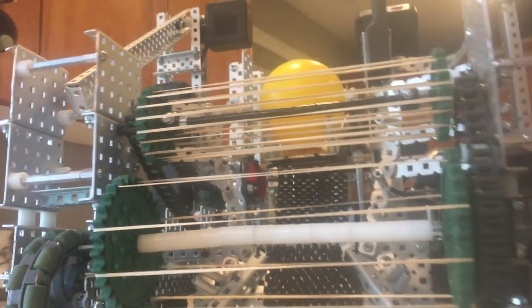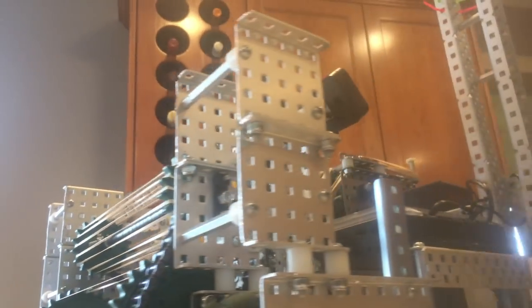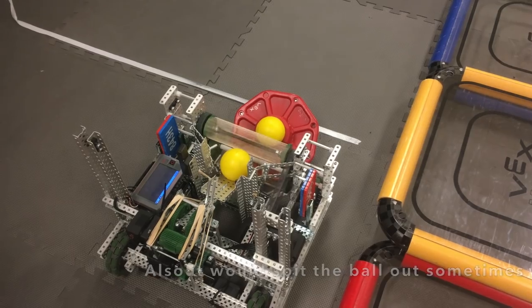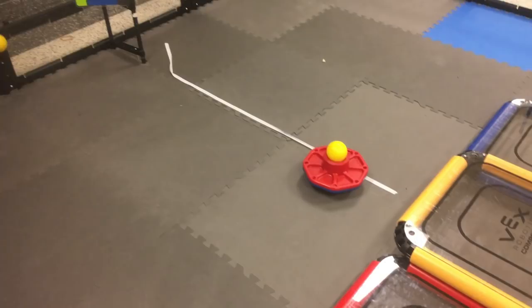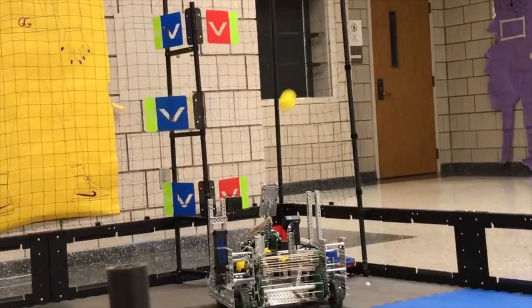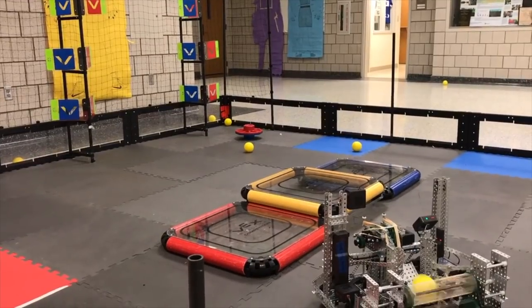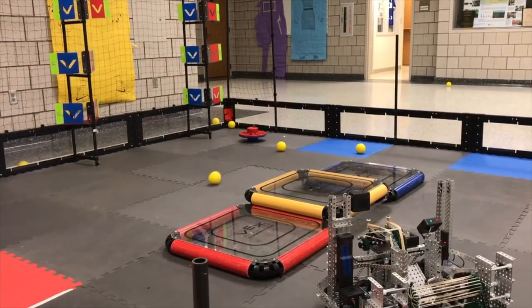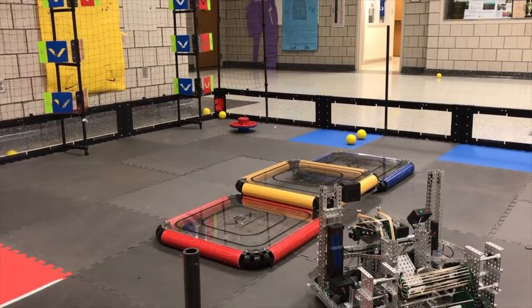The intake was a two-roller intake, which was very effective at pulling the ball up. We found that the ball would get stuck if the rollers spun the same speed, but this was easily fixed by gearing down the bottom roller. This speed also happened to be much more consistent at flipping caps. To prevent a ball from getting stuck under the catapult, we had the intake only intake when the limit switch is depressed. We did have a fail-safe button to still be able to intake if the limit switch was malfunctioning. This, when combined with a non-slip mat strip, helps prevent balls from getting caught most of the time.